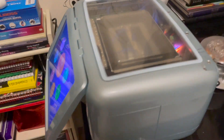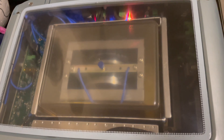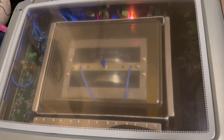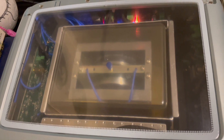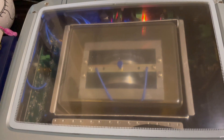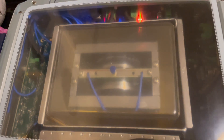Now I'm going to take you through the manual calibration. Let's show the nuclear magnetic resonance system — that's the square box in the middle containing two very high power stationary magnets with one Tesla power, the shimming coils which adjust the magnetic flux to keep the field consistent, temperature controls, and the nuclear magnetic resonance cell itself.